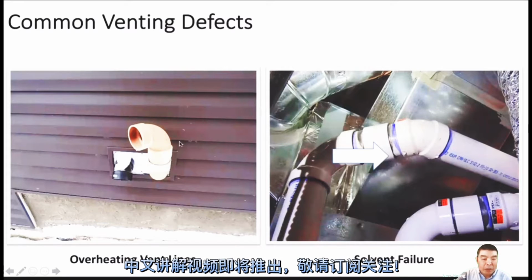So we should go back, check the gas pressure and adjust every furnace, water heater or other gas fireplace. There's a data plate that tells what the pressure should be for the gas valve. Normally for a one stage gas appliance, maybe it's 3.5 inch water column. If two stage, the lower stage maybe is 1.5 and the higher stage should be 3.5.